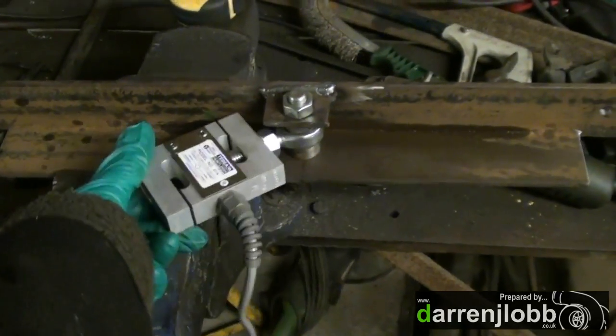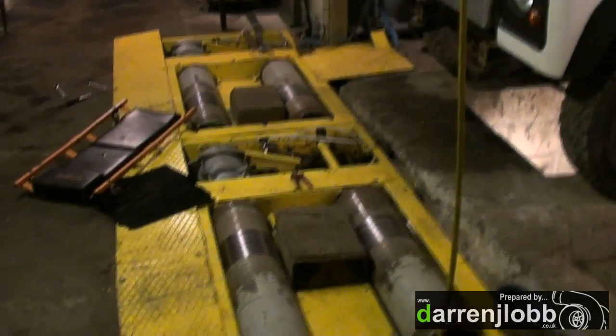I've just made up the second torque bridge and the second load cell is mounted to that. I just need to make up the other arm off the water brake for the other side, and then bolt it all together.